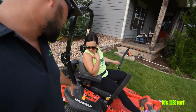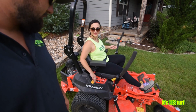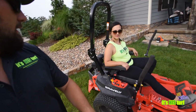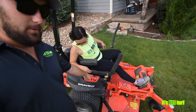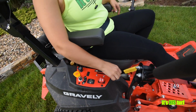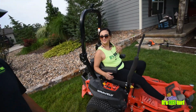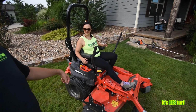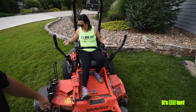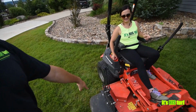So you don't have to choke it. It's already warmed up. All you gotta do is turn the key over. Am I doing that now? Yep, go ahead and turn it over. All right, you're good to go. Now what you're gonna do is throttle it up. All the way. Once you're throttled all the way up, you can go ahead and ignite your blades. The red handle, the red one. You're gonna pull up, and that's gonna turn your blades on.